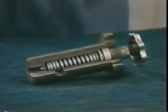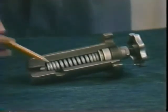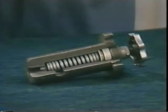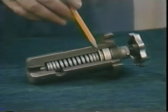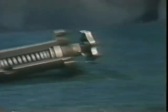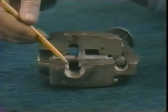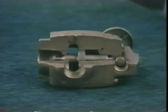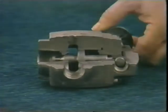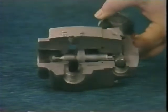Perhaps this would be a good time to compare the actual hardware. This valve has quarter-inch pipe ports and is rated at only three gallons per minute, yet look at the size of the spring it requires. Now, this one here is the balanced piston type. It has three-quarter-inch porting and is rated at 45 gallons per minute, and due to its balanced design, requires only this light spring. Some difference.